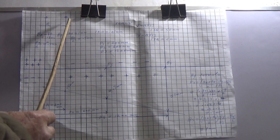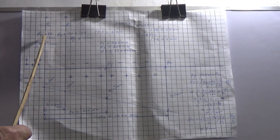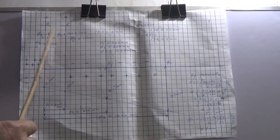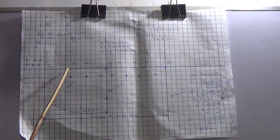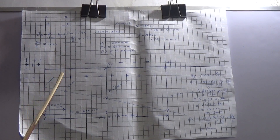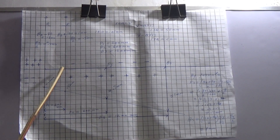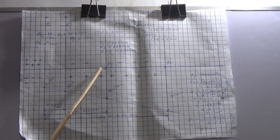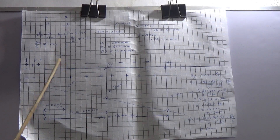This reading is called BA and this reading is called BB. You make zero at the top — this is the total reading, and these readings are taken on the rim. The first dial indicator takes the reading on the pump side and the second dial indicator takes the reading on the motor side. Both readings are taken on the rim.